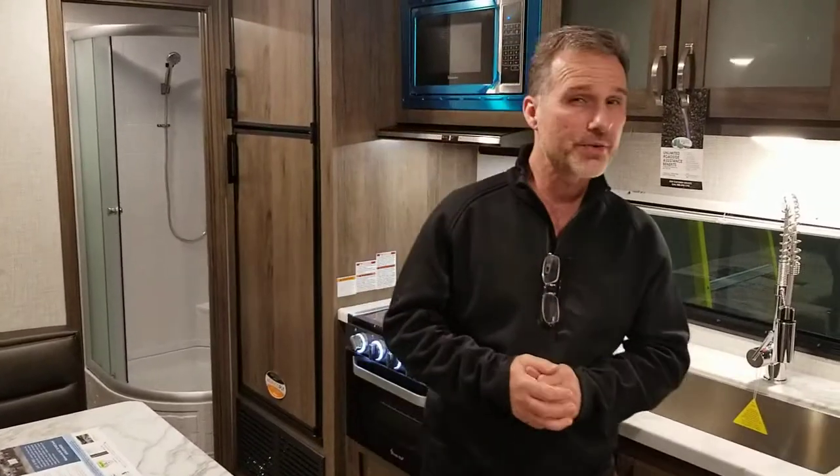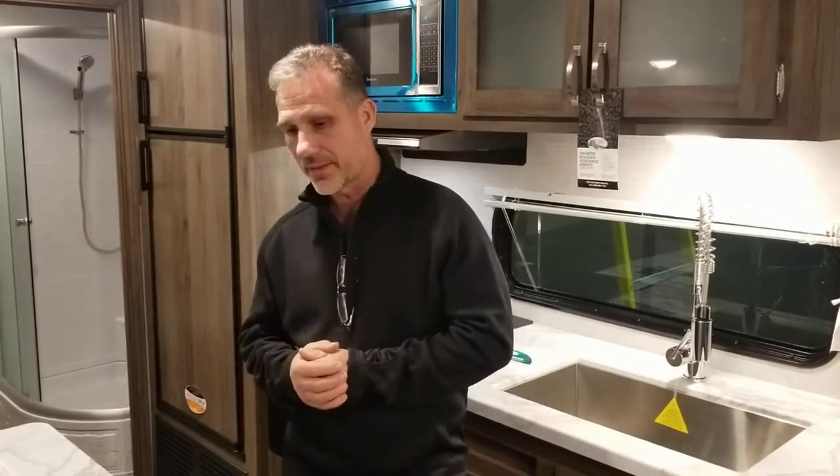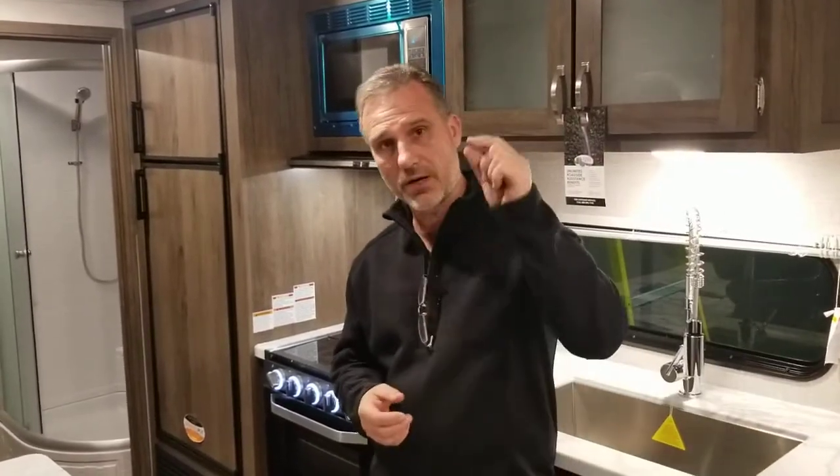There are lots of very interesting features. The De La Terra product line is what I like to call stick and tin construction — wood framing, aluminum on the outside. Normally other manufacturers really cut corners, but not here. East to West has up-built their product. Floor joists are 12 inch on center, decked with 5/8 plywood tongue and groove — that just doesn't exist, only a couple of other product lines on the market do that. 16 inch on center roof trusses decked with three-eighths, and it's a full walk-on roof.